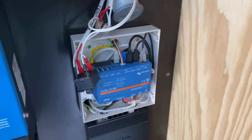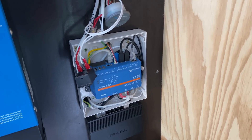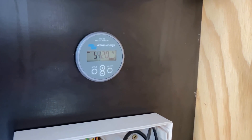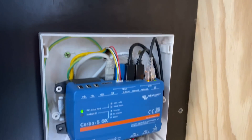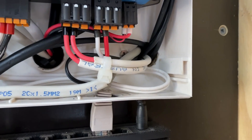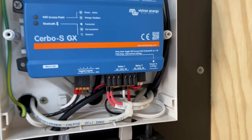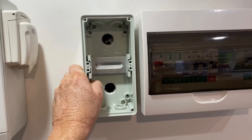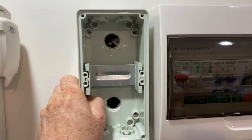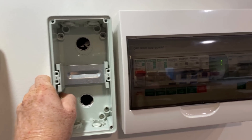I've got to go up the other end now and connect that contactor and the spa circuit up to the off-grid switchboard. I've refitted the BMV — that little relay is out the back. Down here is relay number two. Red goes into the common and white comes out of the normally open. This is where I'm mounting that control relay, so the spa feed will come into here as well as that contactor. We'll feed that from the off-grid board.